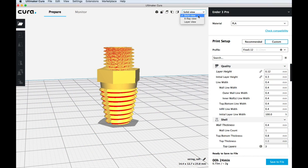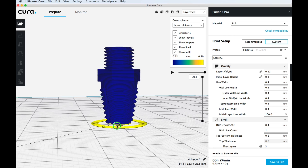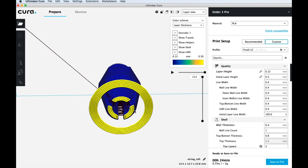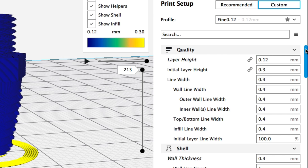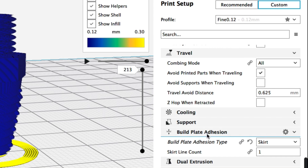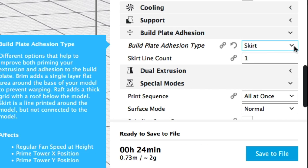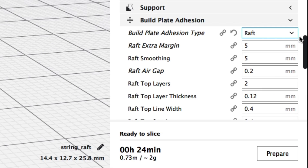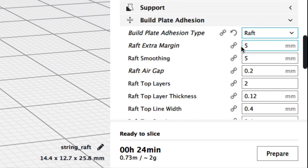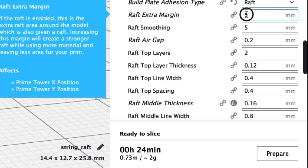Here's the coupling brought into Cura. I've already sliced this with my normal method — a skirt around it, right to the bed. When I flip it up you can see the very small surface area touching the bed, which is why it kept popping off. To change this I scroll down to build plate adhesion, which right now shows 'skirt.' I click the dropdown and change that to 'raft,' and a whole bunch of settings come up. Let me go through the most important ones.